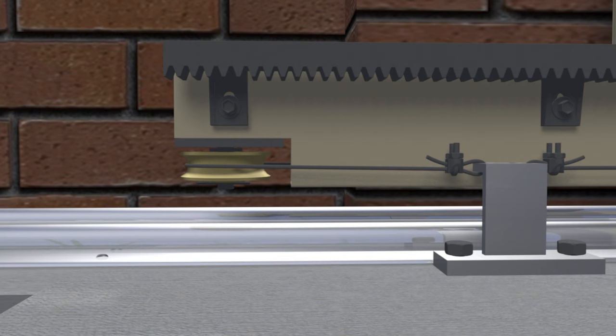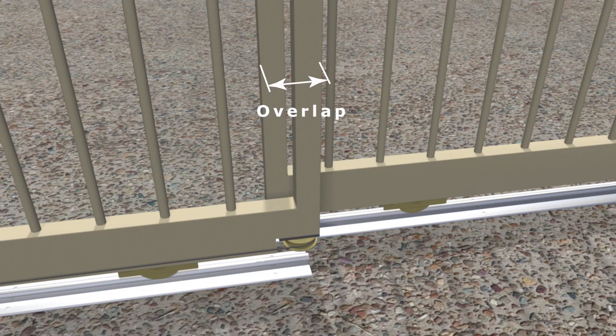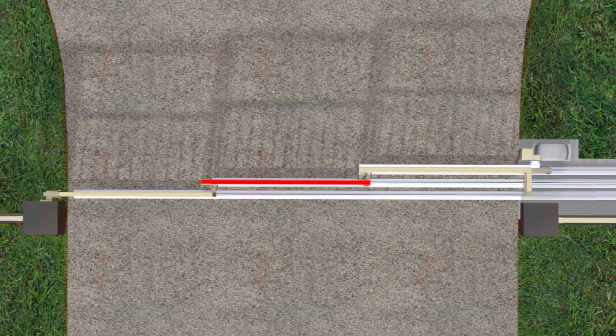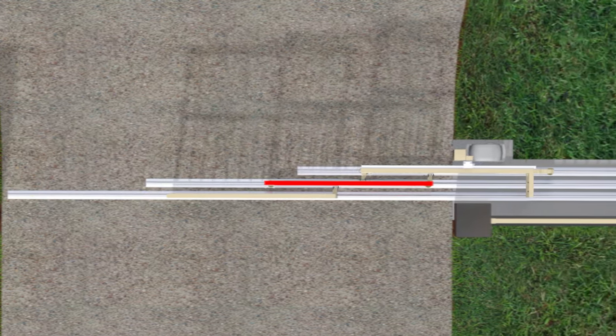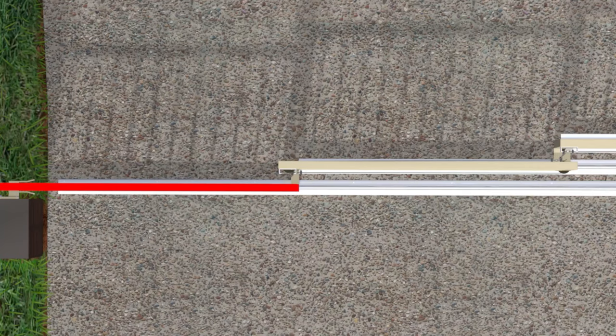The wheels for the wire rope are cut into the bottom rail to make the most of what space there is. This way the overlap between the panels is as small as 80 millimeters. A three-panel telescopic gate has a middle panel that works the same as the front panel of a two-panel telescopic gate, traveling at twice the speed.